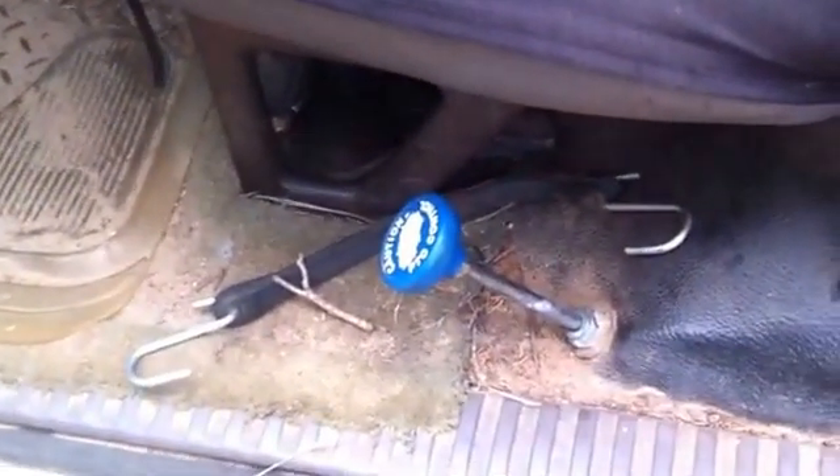Engage my PTO, pull up on that little bar I put in here. I didn't want any hydraulic hoses going in the cab, so I mounted that — the valve body is outside the cab. Got a little wire or bar going down and connecting to the valve body outside, and if I ever develop a leak it won't be inside the cab, it will be under it.